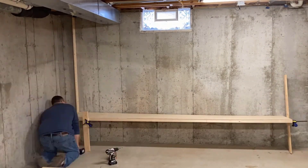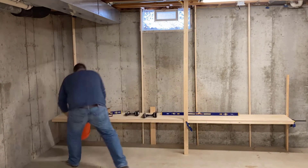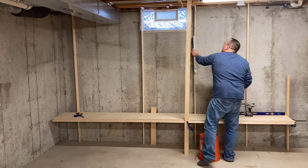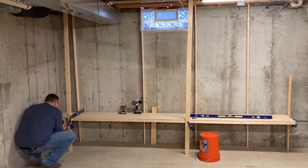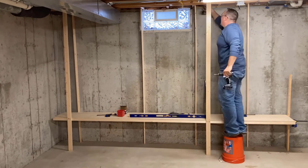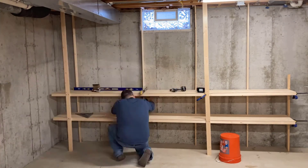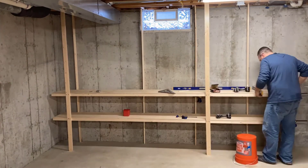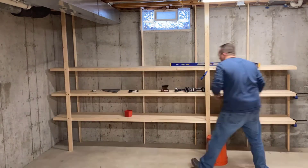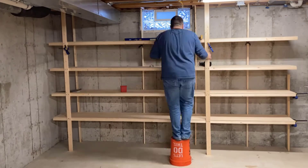To assemble these things in place, I had to use clamps and a little bit of ingenuity. I stand the uprights together and I'm screwing these things into the floor joists on the back side, and the front side is just freestanding. I've got some quick clamps and a couple of levels, and I just go nice and slow, nice and easy, get everything in place, making sure to check for level and square as I go. I want 14 inches of total clearance in between each shelf, and this is for my stuff.